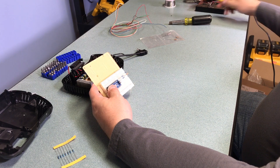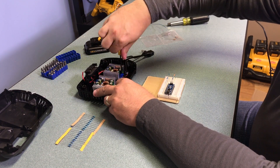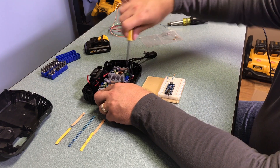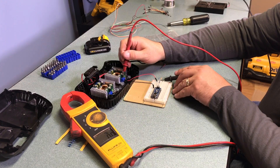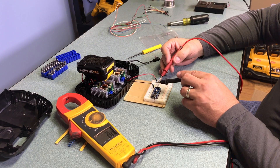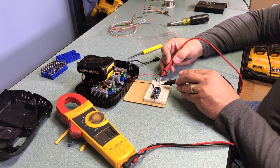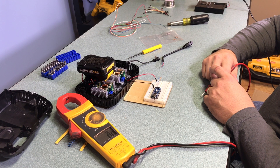I'm going to test the voltage divider by connecting it to the 5-volt output of the buck converter and verify that the actual voltage matches the wiring diagram. I forgot to attach the battery, so let's try again — and with the battery attached I'm getting 2.4 and 2.8, which when soldered up should be much closer to 2.7 and 2.5.